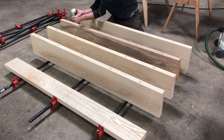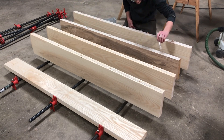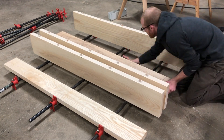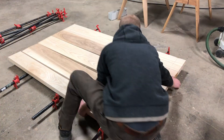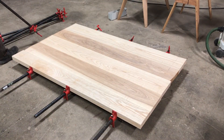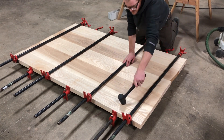It's now time to get these in the clamps. I like to do these size glue-ups on the floor. I lay out a few clamps on the concrete and then lay my boards down and turn them on edge. Using Titebond 3, I put down an even amount of glue on each edge and spread it out with a brush. Titebond 3 gives me a little more working time, so you can see how that can help in a glue-up of this size. After lightly snugging up my bottom clamps, I then bring in my top clamps. Once these are snug, I go back and forth tightening all my clamps, trying to keep pressure even and not flexing the top. This will result in a much flatter surface.